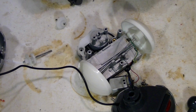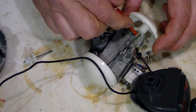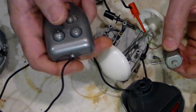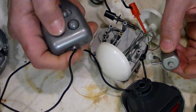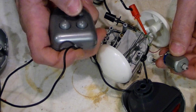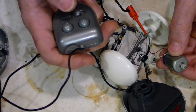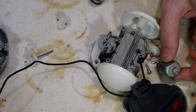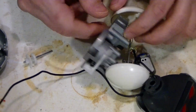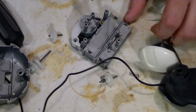And next I want to test to see if I just put power. Okay, that makes it turn off. So that switch is working. Something's not right in here. But since it didn't work with batteries, that means I'm not making contact here, so those have to be cleaned out. Go ahead and desolder everything.